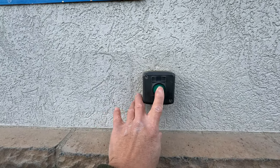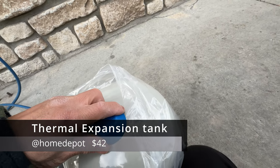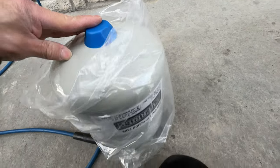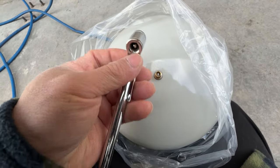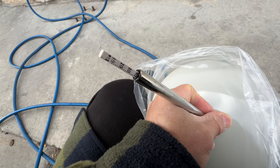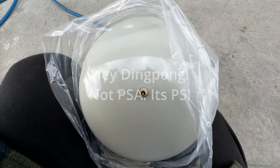I'm going to push the button so the compressor has air going, then grab this hose. I just got this thermal expansion water tank from the home improvement store, and before I install it I need to put some air in it. I came to the gas station since I don't have a compressor at home. Opening it up — the pressure should be around 40 psi pre-pressurized from the manufacturer. Let's check — yep, it reads about 40 psi.